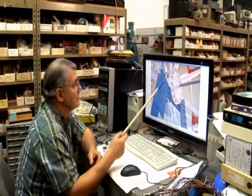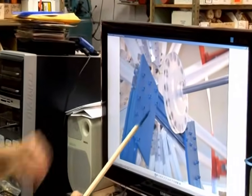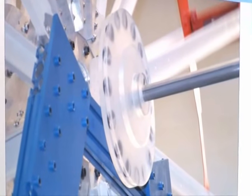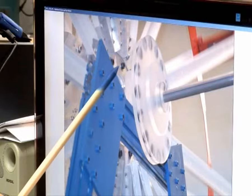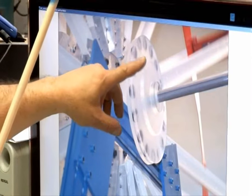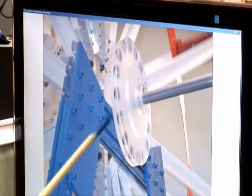So this is the timing plate on the back of the machine. You're facing the front when we're looking at it in this video, but this is on the back, and you can see that there are 16 magnetic poles, all south. The disc sort of looks like this, but it has 16 poles. So these are identical, with the exception that this one has to be big because you need to get the 16 1-inch round magnets all the way around this. And that's running the Hall device on the back. There's a little Hall device in the back, and we'll show it in another picture.